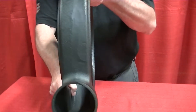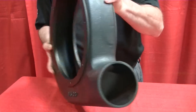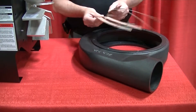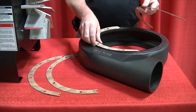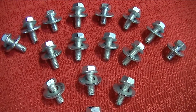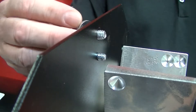After determining the correct discharge side for the application, attach the pump scroll to the pump frame as follows. Locate the four pieces of gasket material — there are two pieces for the inlet side and two pieces for the scroll side. Locate the 5/16-inch by 7/8-inch bolts, quantity of 16, with flat washers.